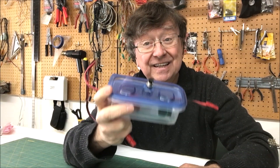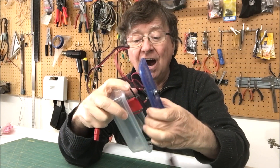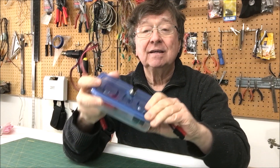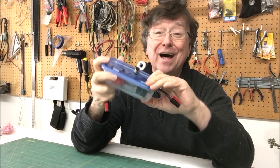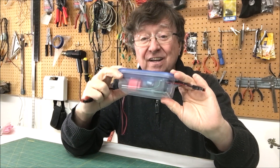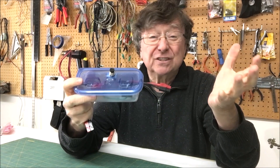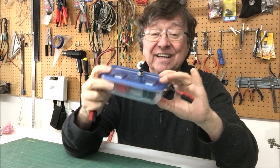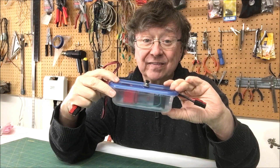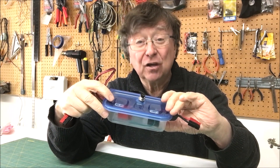Our next step, we needed to change the whole thing from a bunch of parts taped on the table to something we can use. Time for the Ziploc box. This is it. The parts are hot glued onto a plate of acrylic, and then the whole thing is just popped into a box. A lot of folks are appalled, but I like to make my prototype boxes out of Ziploc food containers. They're easy to use, no screws like traditional project boxes, they're five for a dollar, and most importantly, they're clear so you can see the parts inside while they're working. I don't worry about pretty until production.